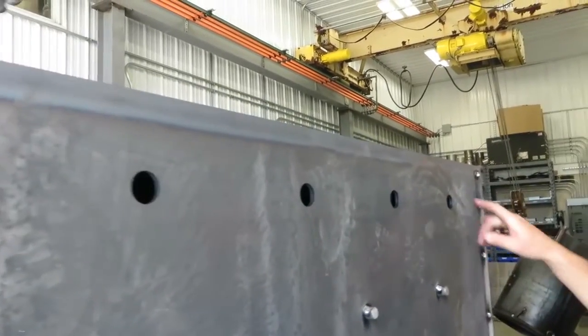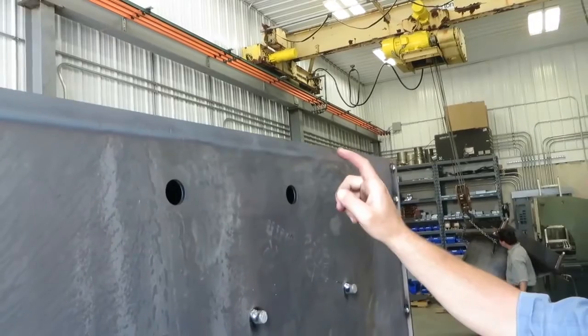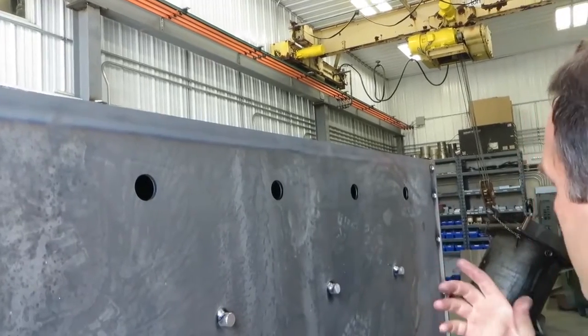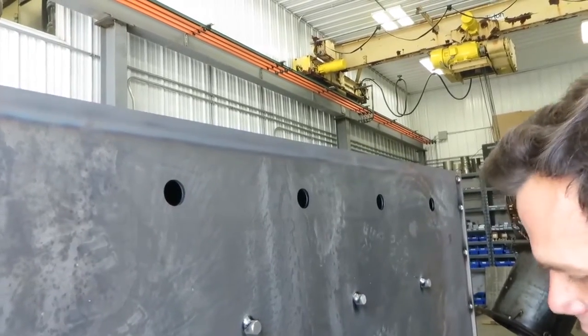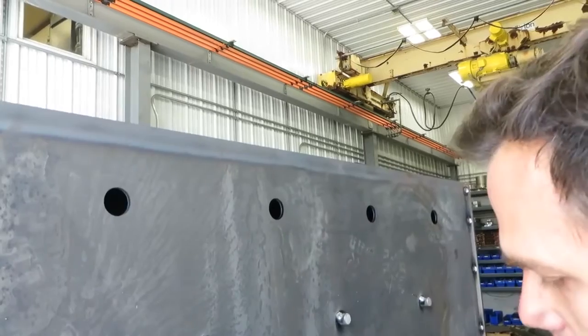This is the ports for all your gauges. Three-quarter inch fittings go in here — controls the pressure relief valve, temperature pressure gauge. And then this will be for an override safety aquastat, so that if you have an overfire situation — for instance, if the ash door doesn't get shut correctly and air can still get fed through natural draft — and the water temperature in the boiler climbs slowly.